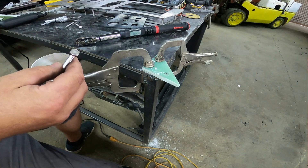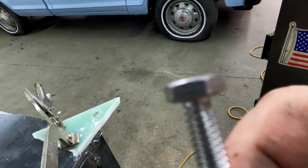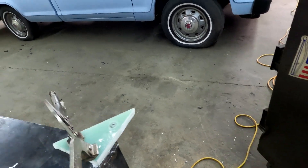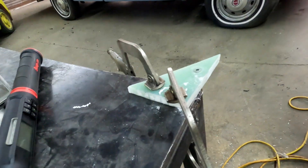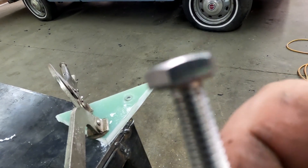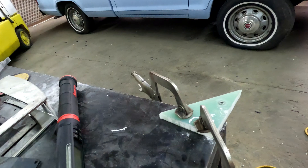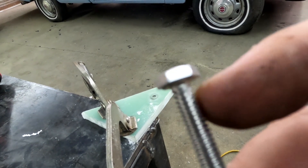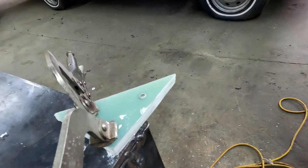Oh yeah, all right — definitely the bolt stretched. You can see it's mushroomed; maybe you can see it right at the very tip. So I think we actually reached maximum torque on the bolt and the half-inch G10 held up. Here is a new one that hasn't been used yet — you can see the head of it is straight. And on this one, you can see where it stretched right there on the neck of the bolt. So yes, this stuff's pretty daggone good.